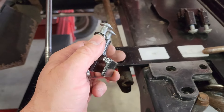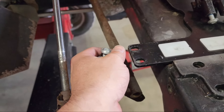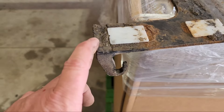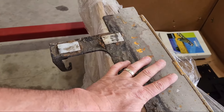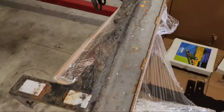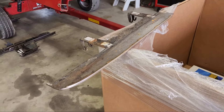The new deck plate on the right side — I had to wait for these pieces that bolt on there, because the original ones from the factory have this hook thing on them that's welded to the deck plate. These are original deck plates on this corn head. I've taken them off once and welded and ground down where they were worn the most, but see how they're cut in bad right here.